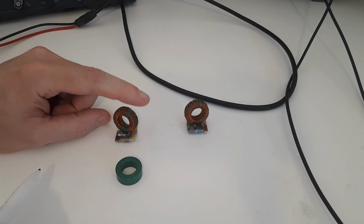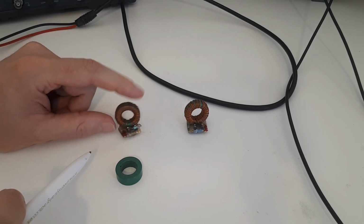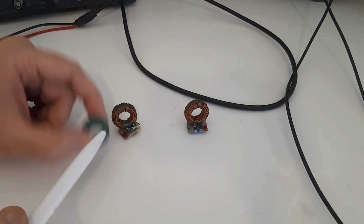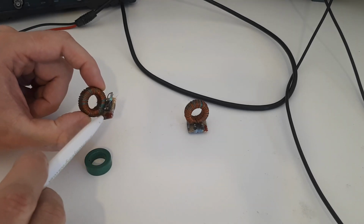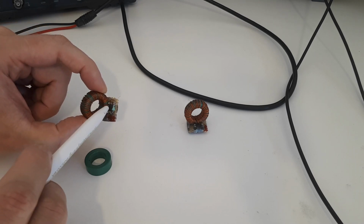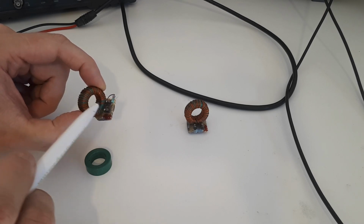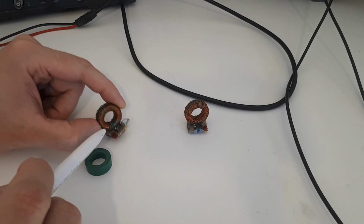Today I'm going to show you how to make this very cheap and simple current probe. It's just a ferrite core. This is actually a metal iron powder core wrapped with several windings, and those windings are soldered onto this very small piece of board in parallel with this socket into which I can place different resistors, so that the resistor and the inductor are connected in parallel.